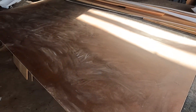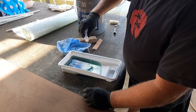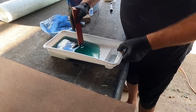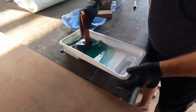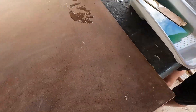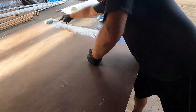We've just used car wax as a mold release agent and we've got it all covered and ready to go. Let's get some resin in the pan, add some catalyst and stir it all up. When making a sheet of fiberglass like this, I like to wet the mold first. This helps to make sure that the layer of fiberglass is properly saturated with resin on both sides.